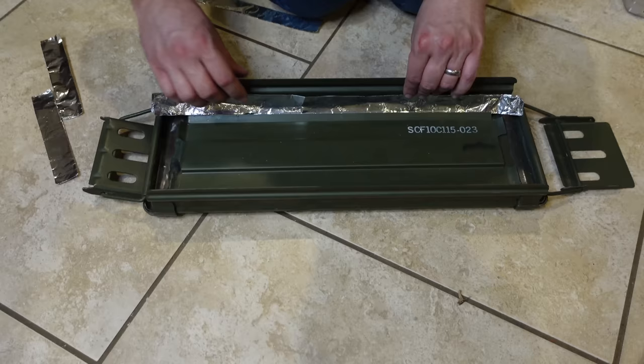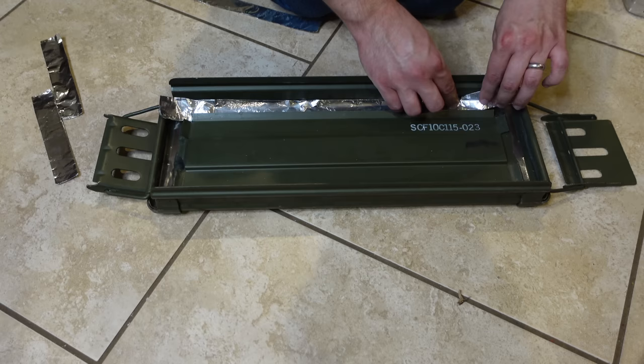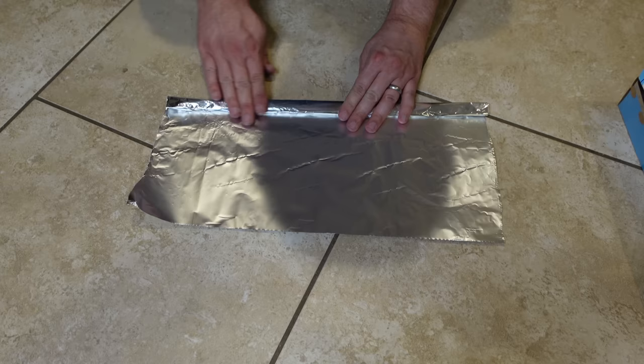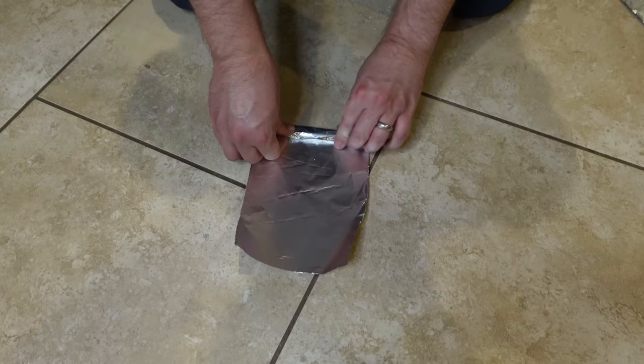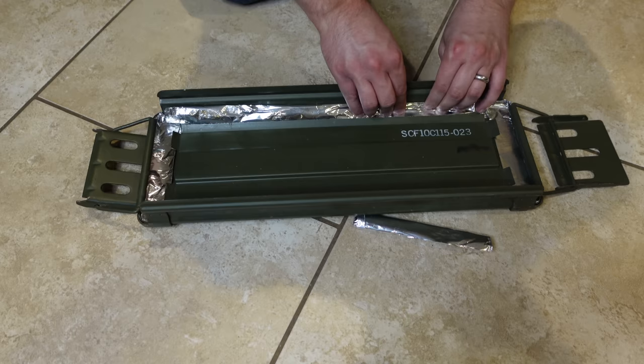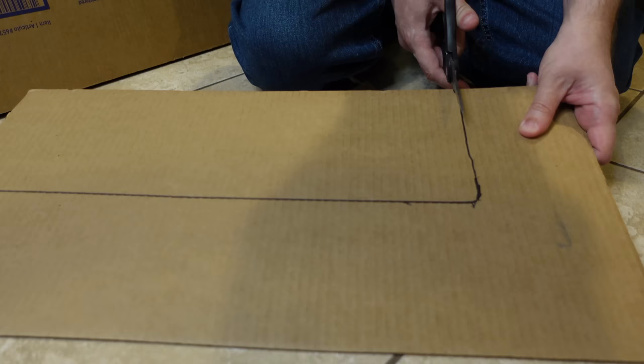After that, I added some heavy-duty aluminum foil to the lid where the gasket used to be. I tore off a piece of foil to the appropriate length, folded it over itself several times, and did this to all four sides. The purpose of this isn't to seal up the can, but it will help ensure that you have as much metal-on-metal contact between the gasket and the lid as possible. Since the old rubber gasket is pretty thick, your conductive gasket needs to be thick as well. So I cut some foam into strips about the same size as the original gasket, then rolled each strip into a piece of heavy-duty aluminum foil. Since the foil goes around the foam several times, it gives you full metal-on-metal contact between the lid and the body of the can. Just be careful installing the gasket pieces because the tabs can be a little sharp, especially on the corners.